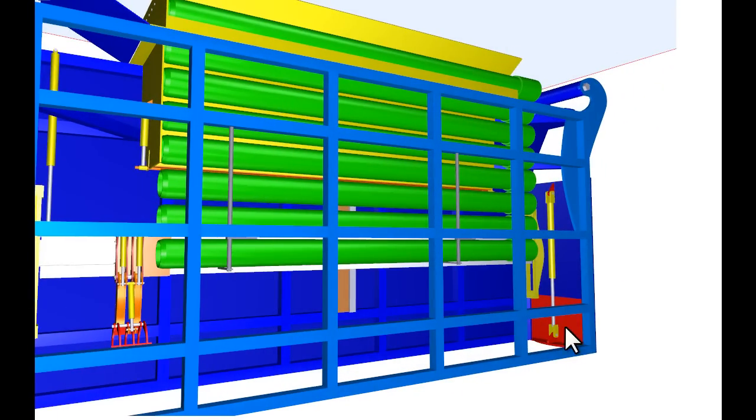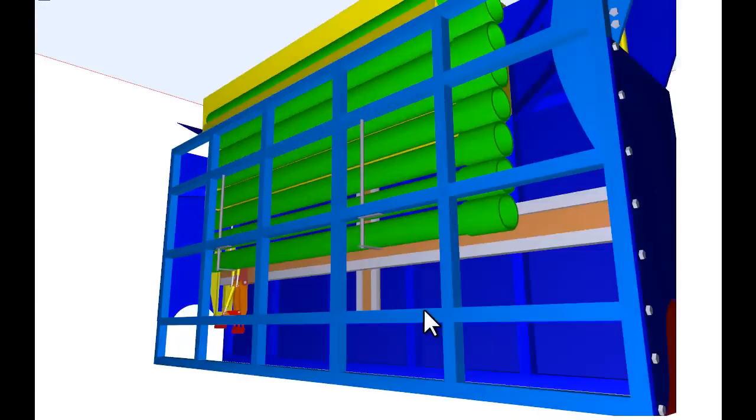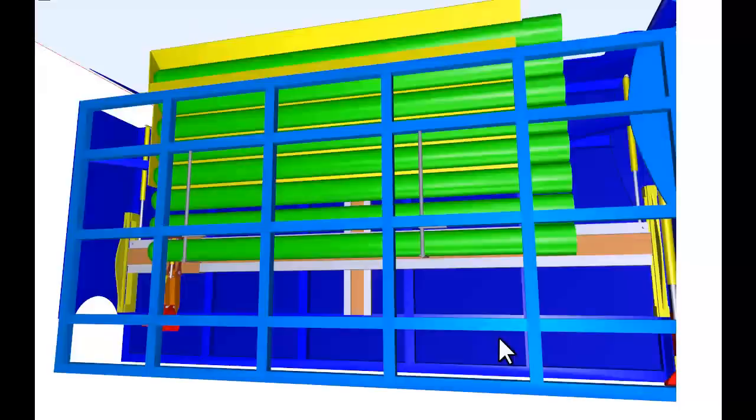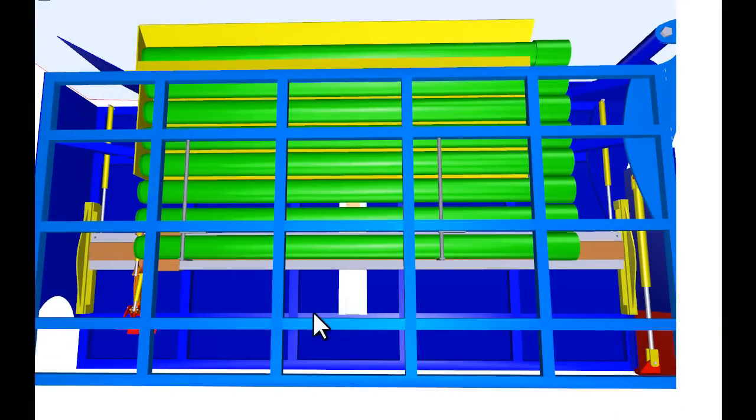The front door right here, you can see the cut out in the front of it, slides up and down. That's so that if you have to lay over an existing pipe to work on, or if you want to push pipe out the front, or you get too much stone or dirt in there and you want to push it out the front, with the excavator, or swing pipe out the front into a manhole.